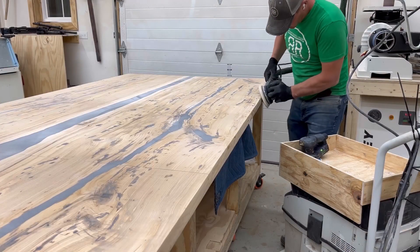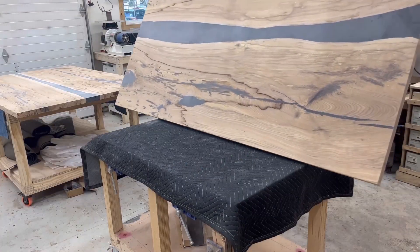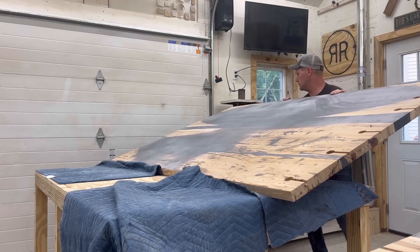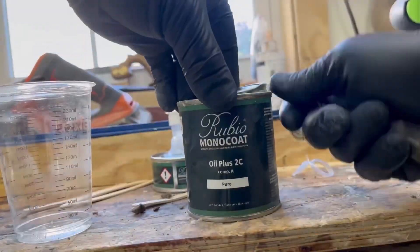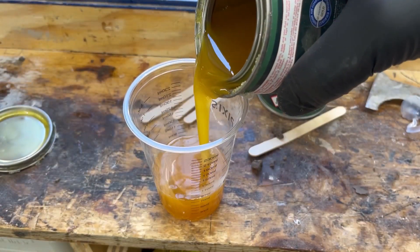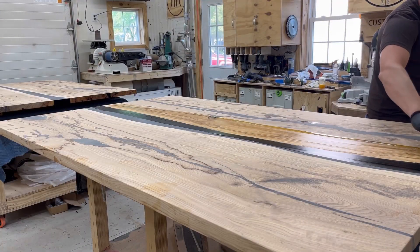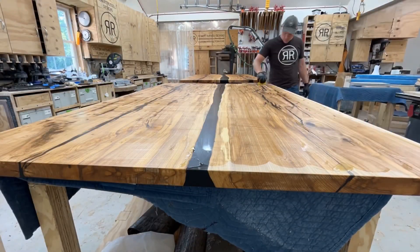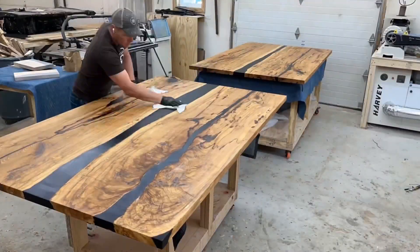I filled the gaps again with epoxy — this ended up being my third of three or four different epoxy fills on this table. Then some final sanding to get the seams perfect. After water popping the table, I mix up the two parts of Rubio Monocoat, apply it with a trowel to spread it smoothly, then buff it off with rags, wiping it as clean as possible so it doesn't get tacky.